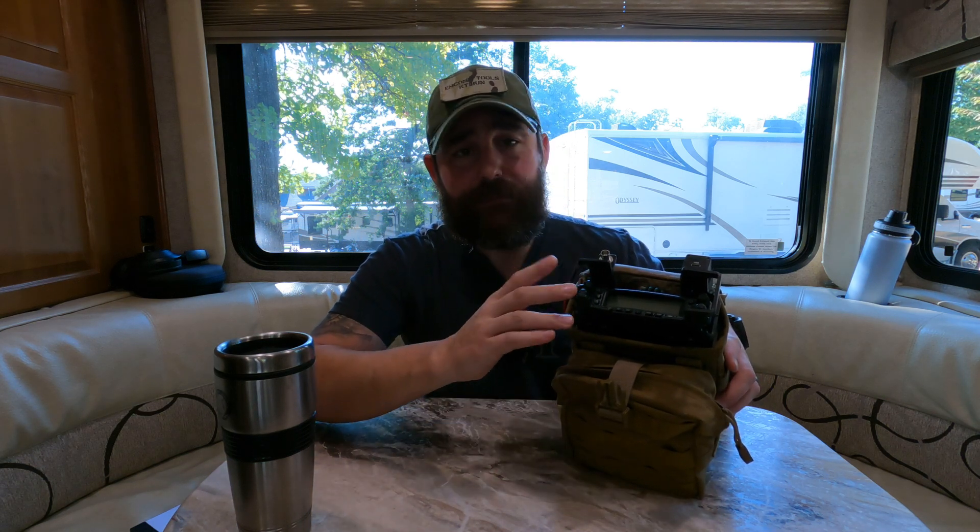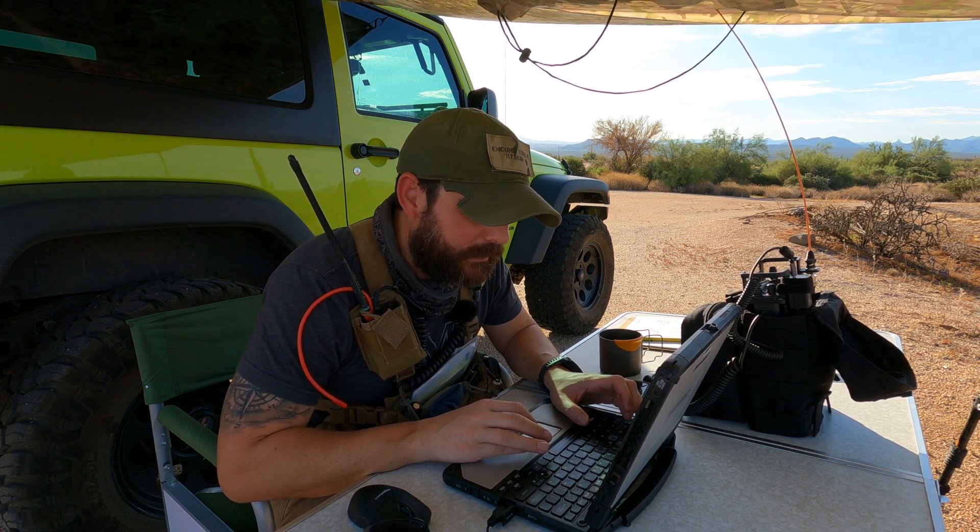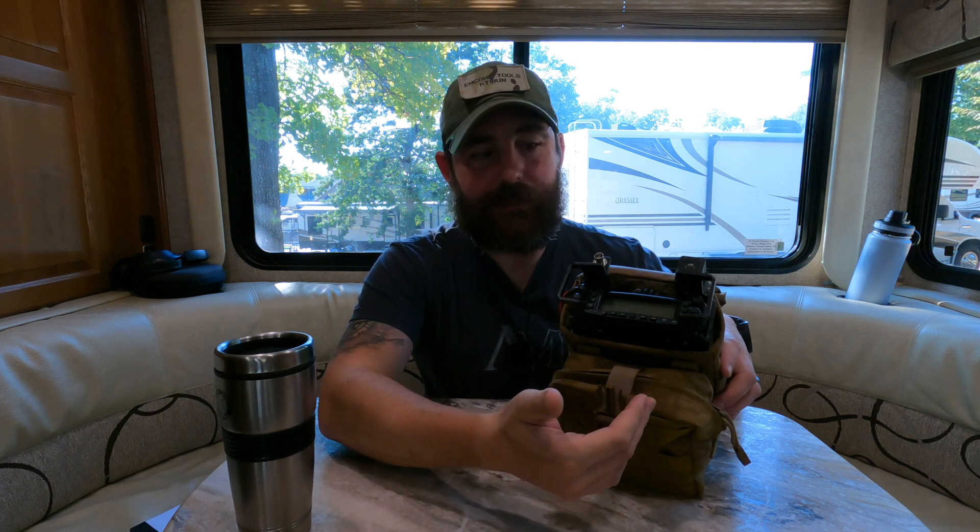So this radio — the third reason why I bought it — is because it has two radios kind of built in, and there are a lot of applications around that. I can actually configure side A to receive and transmit digitally, and then configure a voice frequency on the other side, whether it's simplex or repeater. So in my digital exercises, the cool thing is I can have the DigiRig Mobile listening and receiving, and I can actually transmit to my voice net. And if there are any incoming data signals, my talking on the B-side will not affect it — messages will come through. I can only transmit one at a time, but that's not a big deal.